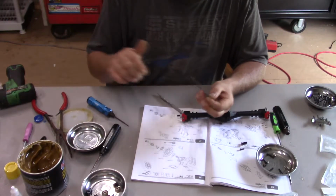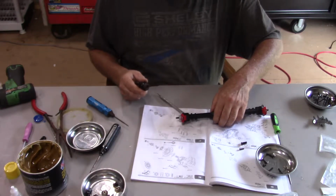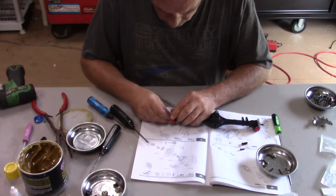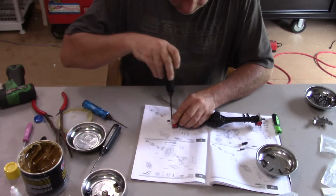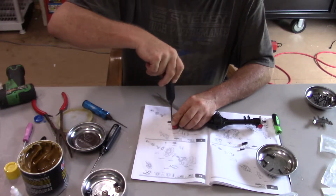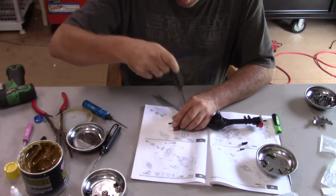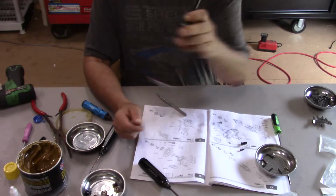Okay, this bit fits just fine. Grab this handle. And line up the hole. Okay, with the hole lined up, Loctite on, screw it down. Do not over tighten. You might feel a rough spot, but if you over tighten, you'll have a heck of a time getting these back out if you need to. All right, so there you are. Got this end, that end, it's all done.